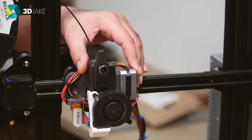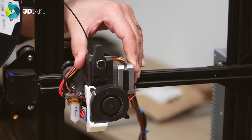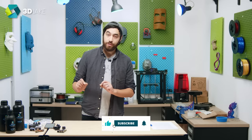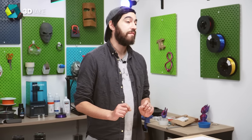So it's beneficial to have a nice, light printhead on your printer and control accelerations so they don't go too high. But input shaping cancels out these vibrations by signaling the stepper motor to perform an opposite directional change, proportional to the unwanted vibration, so you can go faster without having to worry about vibrations.